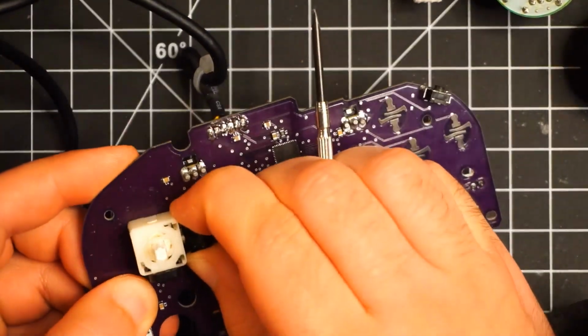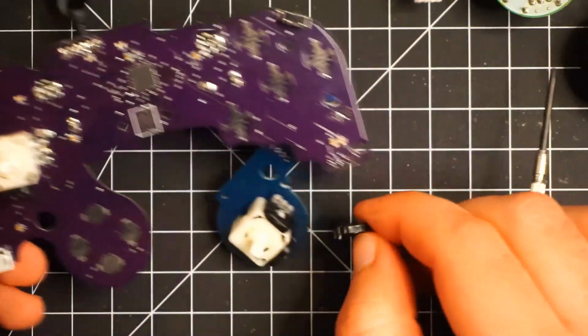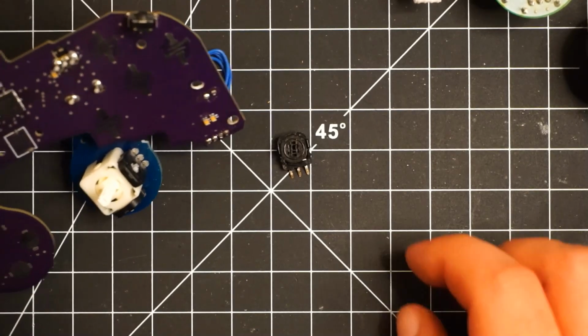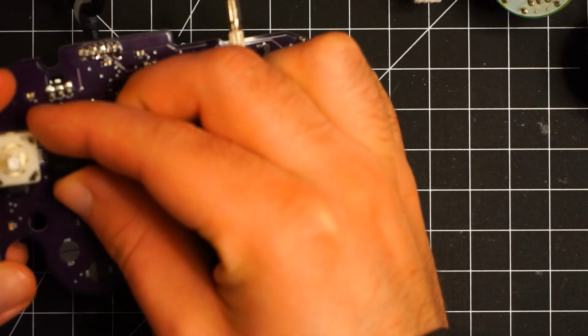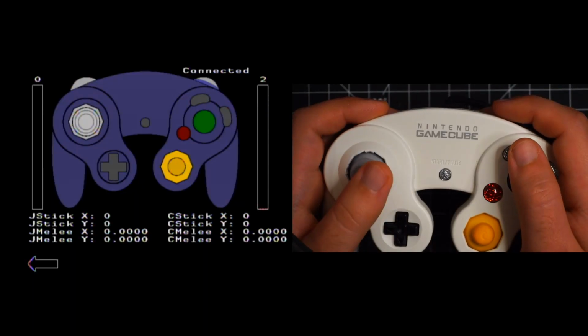In addition, all Goomwave DX motherboards come with brand new, from the factory, OEM potentiometers that will last longer than the ones you find on a used controller. We will also be selling new potentiometers in the future so you can easily replace the potentiometers yourself with only a tri-wing screwdriver. How to use Goomwave DX.